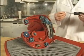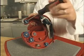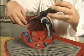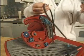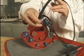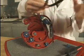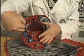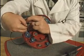Installation of the Mega Blade is just as easy as installation for the standard blade, with one exception: removal of this upper pulley here for added clearance. Because there's no flexibility in the Mega Blade, you'll need that extra space. Wrap your belt around the blade 360 degrees, pinch it closed, and drop it inside of the raceway. Hold it tightly, and reinsert the pulley.